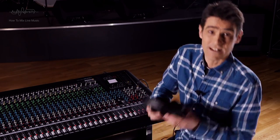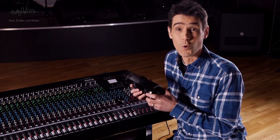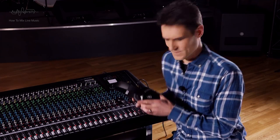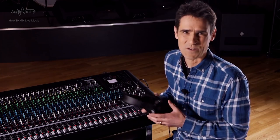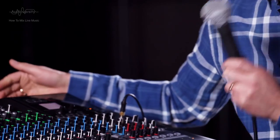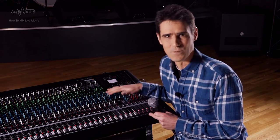Aside from the obvious mics, cables and speakers, what other equipment should a sound engineer have in their bag? Headphones is the first item — they should be a closed-back type, covering the ear for best isolation from all the sounds going on around. Yamaha makes some really tasty ones: the HPH-MT8, 7, or 5. Get the best ones you can afford. Then, a talk-back mic is going to be useful — plug it into the desk and it allows you to communicate with the band on stage without having to move away from the mixer.